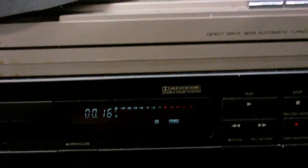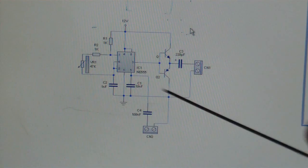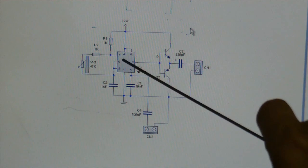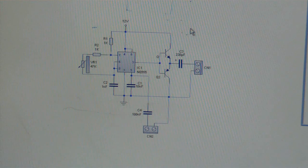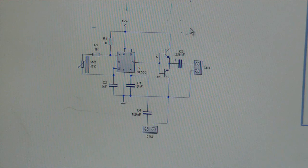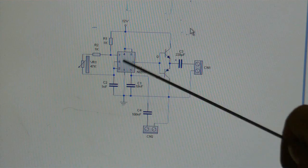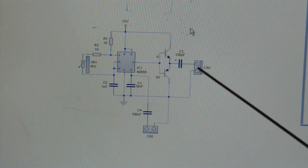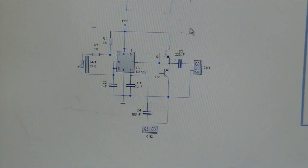So I think we can say all in all that's a pretty interesting experiment. And before we go, we'll just go over a quick schematic. So this is the basic circuit — got the all-important 555 timer right there, and the transistors to buffer it. It's not important to make and model the transistors, just so long as one is NPN and the other is PNP and they're both a matched pair. This is where the audio goes into the chip, and this is where it comes out and you connect either a speaker or a tape head. And that's basically it.